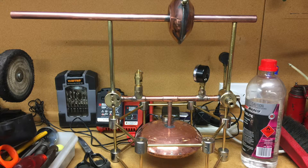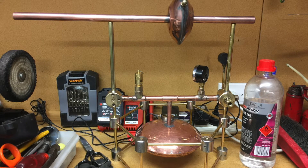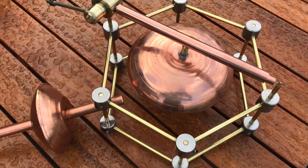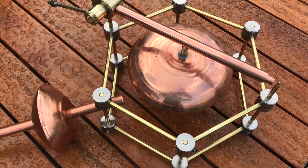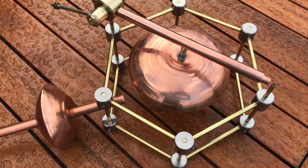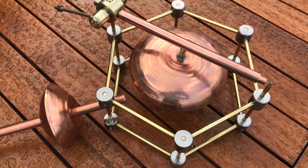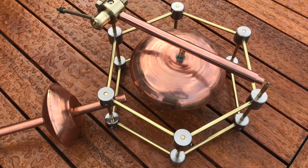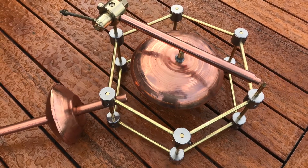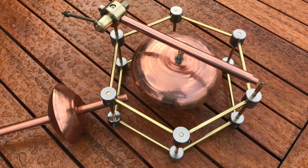In this photo you can just see the six-inch buff on the left-hand side that I use for polishing everything. Here you can see why I made this cage to protect the boiler without actually attaching anything to the boiler apart from the actual steam outlet and filler cap. I think it serves a dual purpose, both supporting the boiler and protecting it. This was made in the same way as the rotor — two bowls joined together with a rolled-over edge which was soldered.